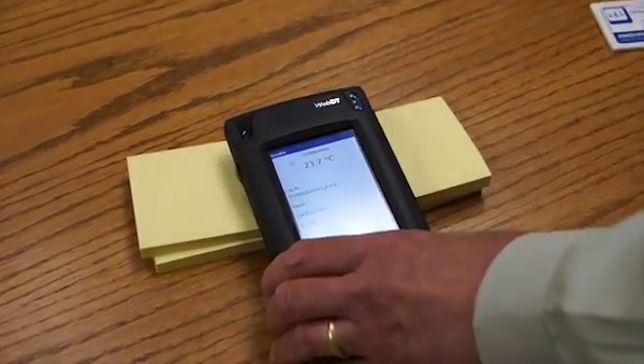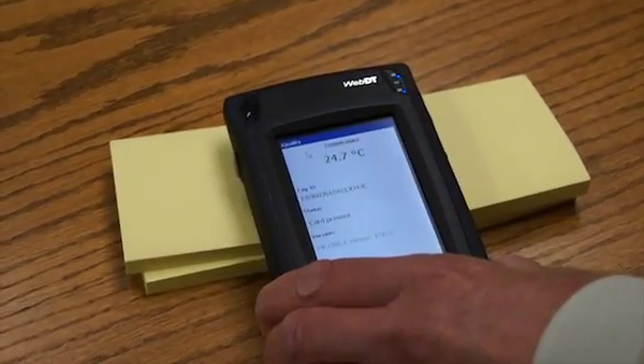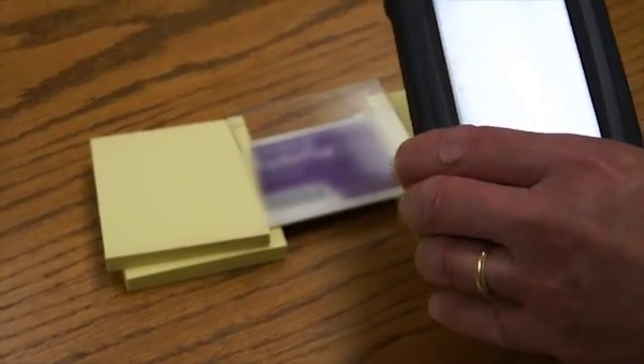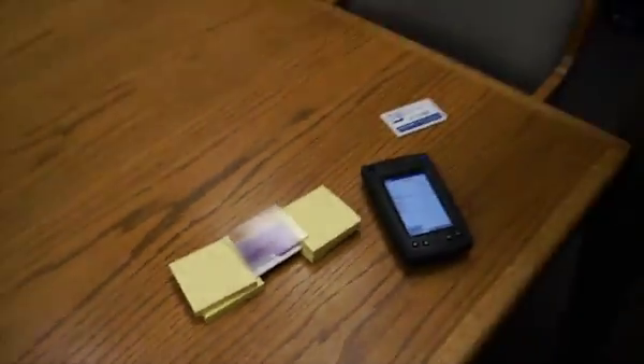So now we're at 23.7°C, and when we take a new reading on this tag, it's gone up to 24.7°C. That's one whole degree, even though the reader is roughly a half an inch away from the tag. And that can cause problems in supermarkets and other places where these tags are deployed, because you can get a false but believable reading that the temperature is actually higher than it really is if the reader is held on the tag for a while.